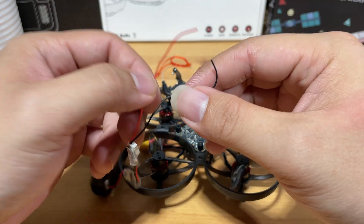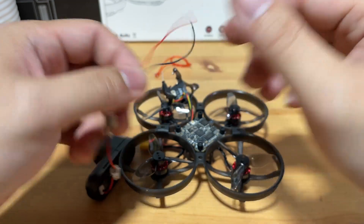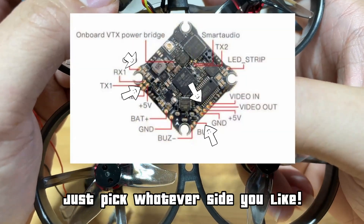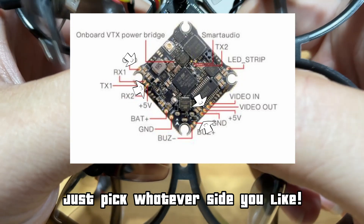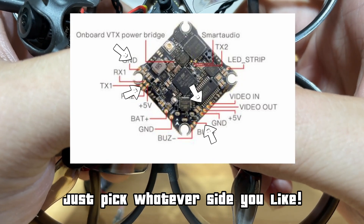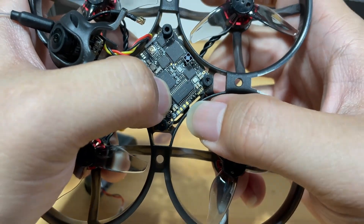For the wiring diagram, as we have previously discussed, we are going to solder on a power cable and a ground cable. The pads we're going to be using are a 5-volt and a ground — it's super tiny, but it's right here. This one is your ground, and this one is your 5-volt. Okay, we can begin the soldering.